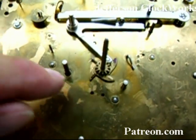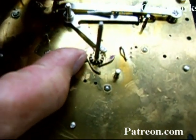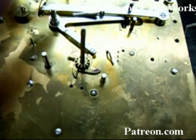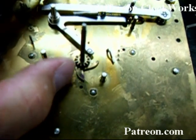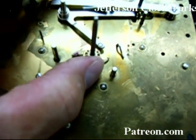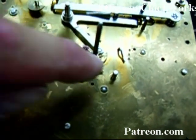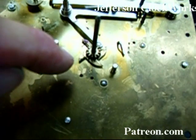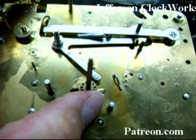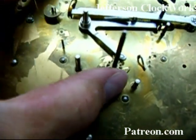This is the chime release star lever, or gear. As it turns around, I installed this lever again so you could see what it does. That's for the quarter hours, and the hour I painted with a little bit of blue ink. The quarter hours and three-quarter hours only lift a certain amount, and the full hour lifts it up high enough where this lever causes the strike to go into warning.